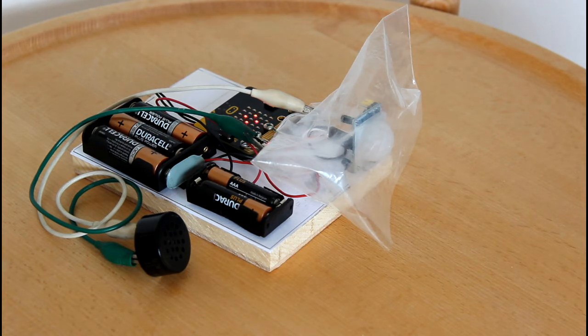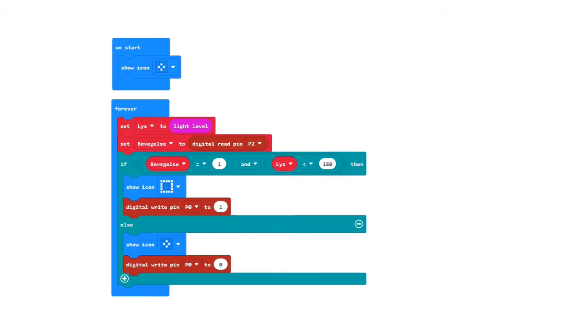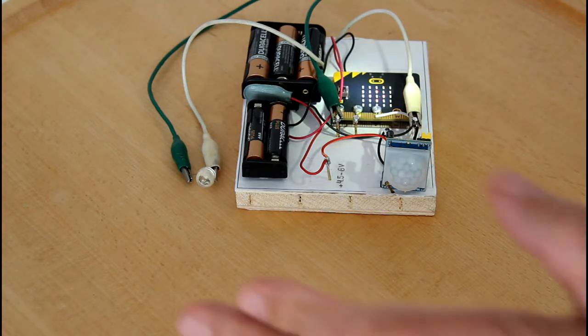Now I want to emulate a system where the light is turned on if there is not so much ambient light and if there is movement in front of the sensor. I have therefore connected an LED to P0 and ground. The program has changed a little bit. With the amount of light I have in the room, the LED starts to light up when I move my hand. But if I illuminate the micro:bit, it does not respond.